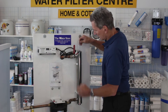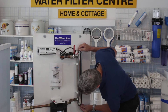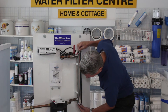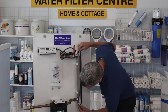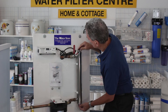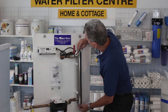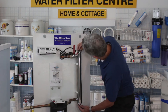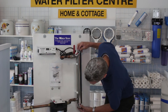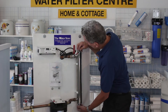Next, slide the sleeve back in. An O-ring goes on the bottom and another one goes on the top. Make sure that the sleeve protrudes an equal distance out of the top and out of the bottom. Once you get that in place, put the other O-ring on the top. With the Exalite systems, I don't recommend lubricating the O-rings with silicone or plumber's silicone grease because they tend to slide around and you don't want that to happen. The closed knurled nut — the one with the closed end — goes on the bottom. The knurled nuts just get hand tight.